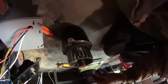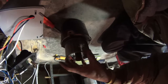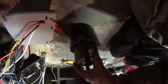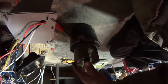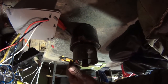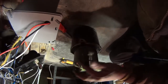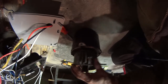Another way you find out this motor is bad is too much play over here — bad bearing. It's squeaking and got too much play, so this motor's gotta go. Look at how much play you got. Even make it — look, you heard that. So this motor is shot, I want to put a new motor over here.